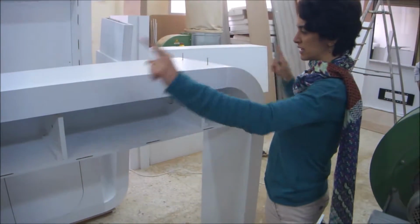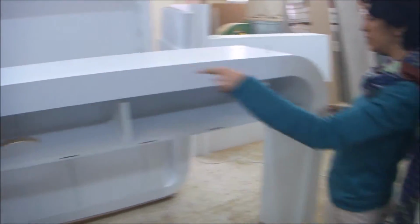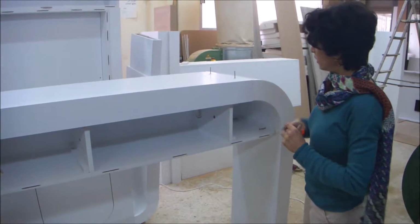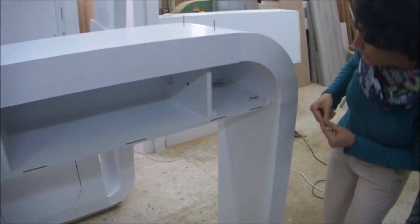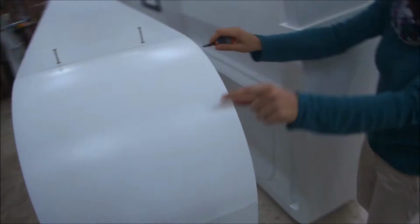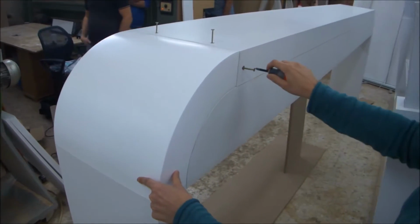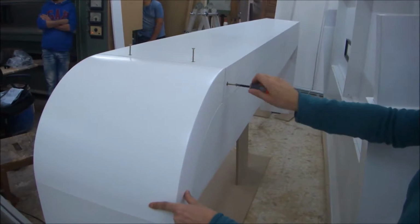So once the bridge is assembled on the two sides with the columns, as you can see on the left and right side, you need to place 10 screws, the long ones, 2 on top, 2 inside here, we can get closer, 1, 2, and 1 at the back, and then tighten them well. So you have 5 on this side and 5 on the other side, symmetrically opposite.